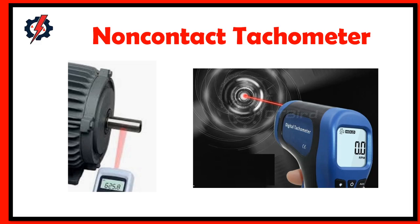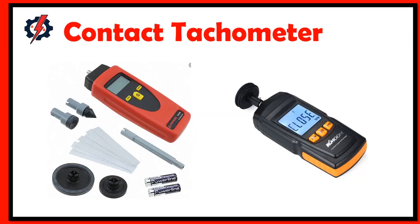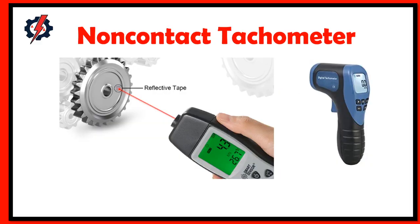There are two types of tachometer: contact and non-contact. Contact tachometers are used to measure the rotational speed of a rotating object. The shaft of the rotating motor, for example, is coupled to the shaft of a handheld tachometer by friction. Since they are coupled, the tachometer shaft will rotate together with the speed you are measuring. The non-contact tachometer measures rotational speed without physical contact. The phototachometer emits a beam of infrared light which is directed towards the reflector.